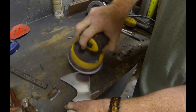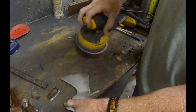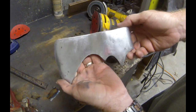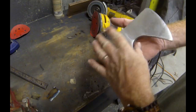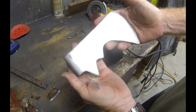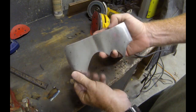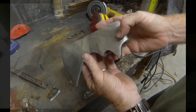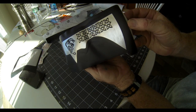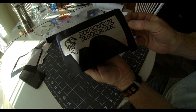After finishing with the angle grinder, I used an oscillating sander — first with 80 grit paper, then very lightly with 220. If you look close, I did leave a lot of those little dings, divots, and deep scratches. That's all going to add to the patina of the finished product. I don't want this to look brand new — I want it to look aged.